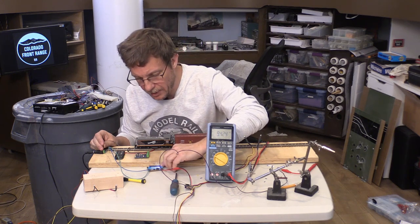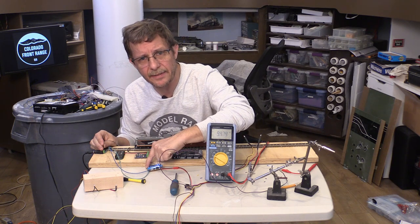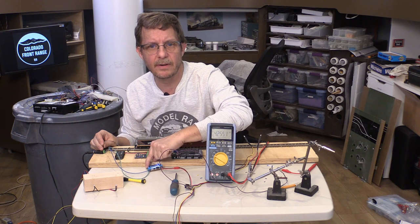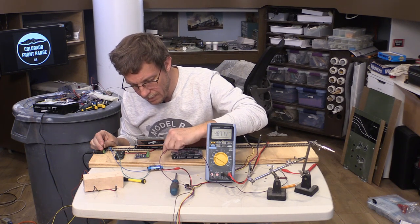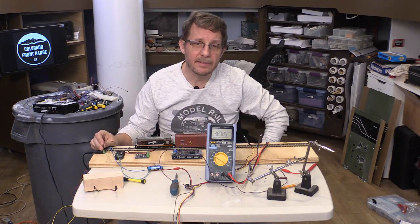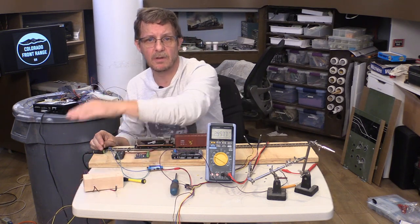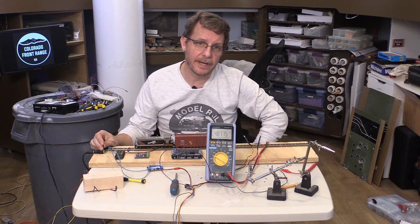In a digital, I've been experimenting with this. This is not how Jeff originally designed it. He originally set this up to be used as a panel. I'm experimenting with getting its voltage down to close to 5 volts and getting it to work, as you can see. And the advantage of that is then I can also feed that into an Arduino and it would trip it because it would be considered somewhat like a digital signal, because it's dropping below the 3.7 volt threshold that it needs to turn it off and it's coming above it to create that signal.